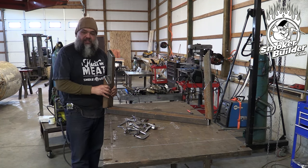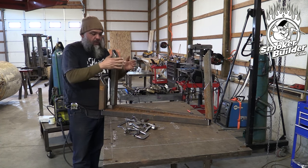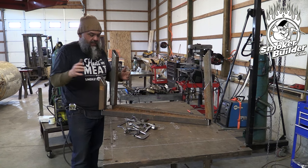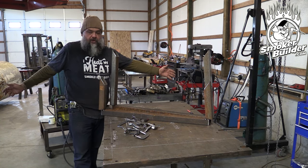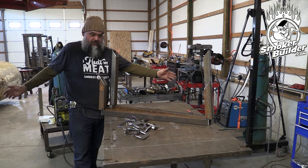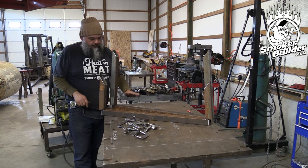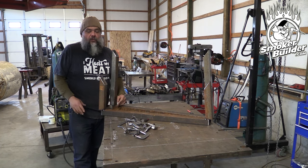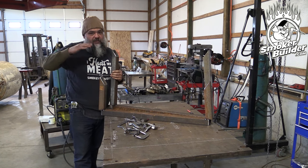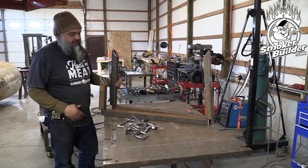The next step: we're going to separate these, go to the cooker, and lay out where we want these legs to live on the different cook chambers and the firebox. Make marks on our rail — our two by four inch rail — then we're going to get that up on some jack stands, level it out, square it up, lay these cross members in, and tack them all in place. Once all that's welded in and good to go, we're going to lift it up and scoot it underneath. So stick around and watch us get this thing mounted.